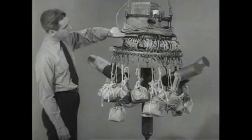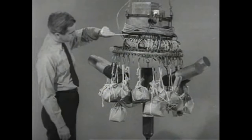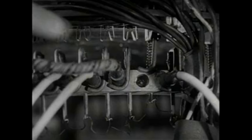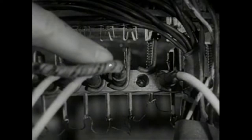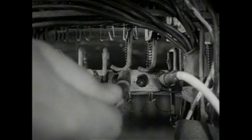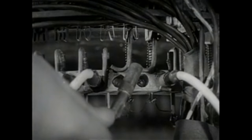The switch ring is placed above the ballast ring and has 72 holes holding 72 switch plugs. Each switch plug holds a spring-loaded switch. When a switch plug is ejected, the spring forces the switch upward into contact, selecting the next piece of payload to be released.